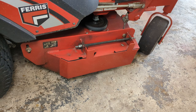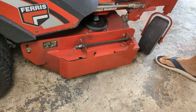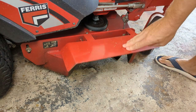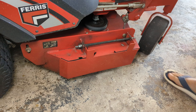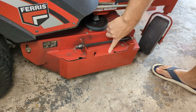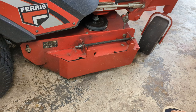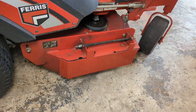A couple of weeks has passed. As you can see, I do have a tube in here — I ordered it from McMaster-Carr, I think it's a piece of 4130 chromoly. What that allows me to do is tighten down this nut to clamp this piece in place. Now if I lift it up, it stays there — I can put it in any position I want and it holds. I've mowed maybe two or three weeks' worth, probably half a dozen lawns. It works out really nicely. The only thing I don't like is grass sometimes flies up through a small gap between the deck and the plate — it's less than an eighth of an inch, but it does come up there. I put a piece of adhesive-back felt in there, but it's just getting torn up.